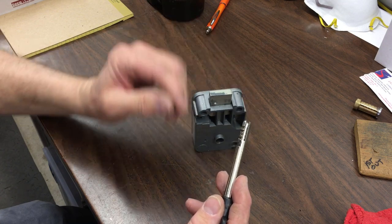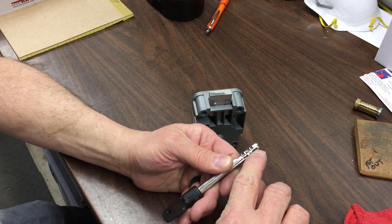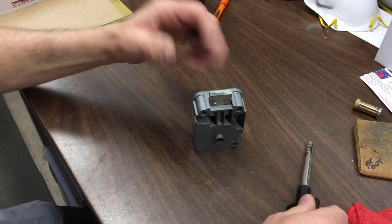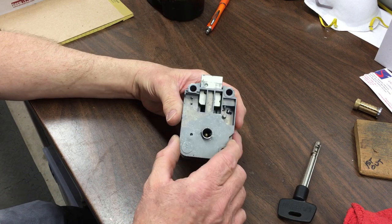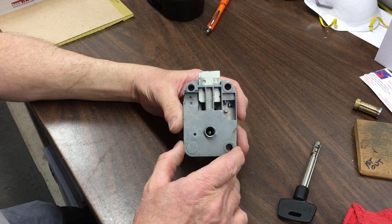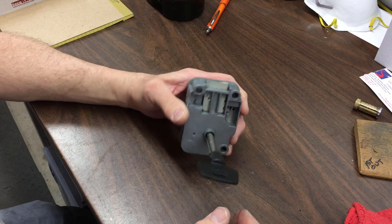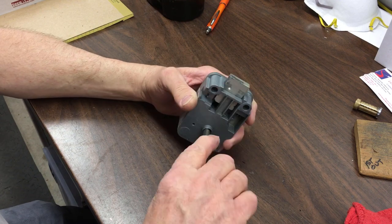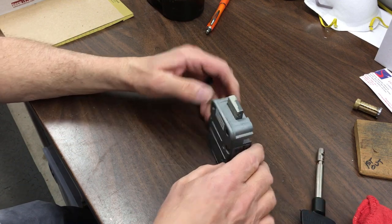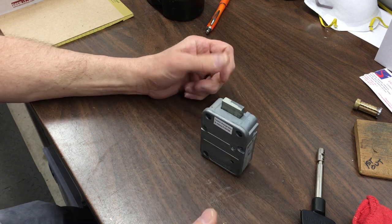Even as I've done work on this, it's still full of grease coming out of here. But I ended up having to manipulate the wheels that are inside here until I could get the key to operate properly. We gave it one more opening and replaced it. So never oil these kinds of locks — never lubricate these kinds of locks.